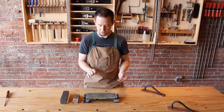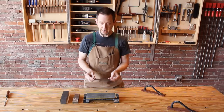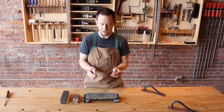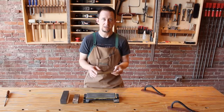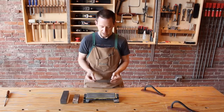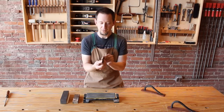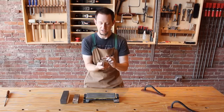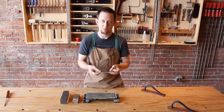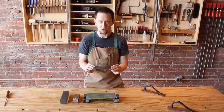To do that we're going to use a diamond stone. This is a 600 mesh diamond stone and it's fine enough to generate really good results but it's not so fine that it takes forever to get to those results. I also like using diamond stones because when you're using something like a water stone and you're trying to flatten the edge of this scraper, it'll leave terrible grooves in your water stone. So stick with the diamond stones — they work really well.